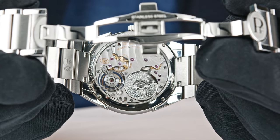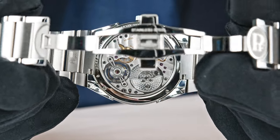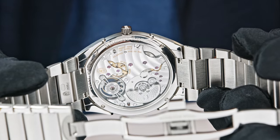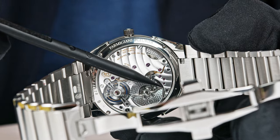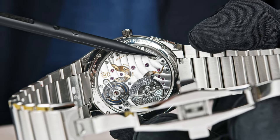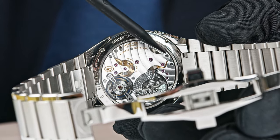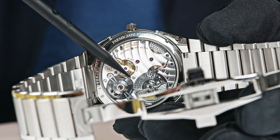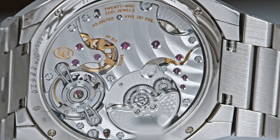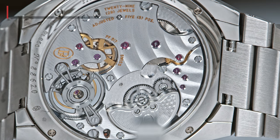Platinum rotor. Minute tourbillon. And you have the Côte de Genève circulaire in this finish — you see the Côte de Genève, how they look? They are round, they look like waves. They come out of this area and literally spread over the entire movement. The finishing, beveled edges, everything is done. It's Haute Horlogerie. Power reserve of the watch? 42 hours. Also 21,600 — 3 Hertz.